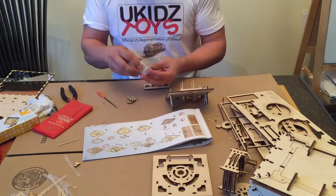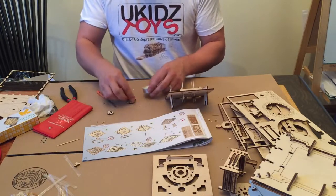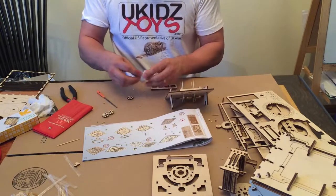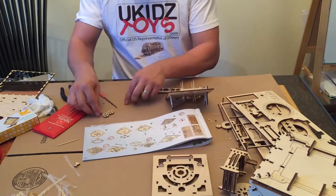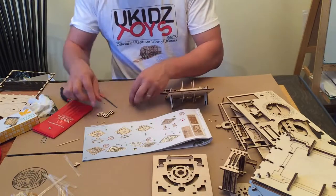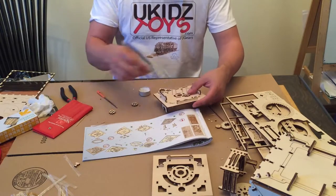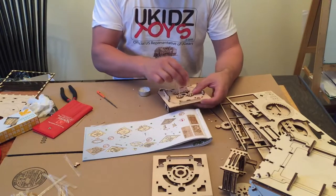Do need lubrication, so just stick them in there to get some lube back onto the gears. You can also use a toothpick and do every gear one by one, but it's up to you. I'm just sticking them in here to make sure that we get some lubrication on there. Clean it off a little bit to make sure that it's nice and clean. And then you put those gears on top, onto those toothpicks that we just inserted. There are four of them.